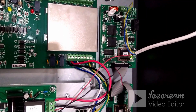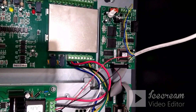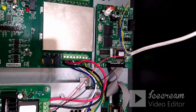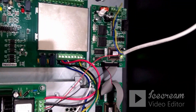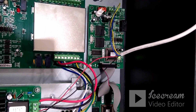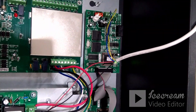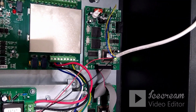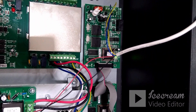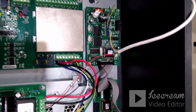In summary: when connecting a GST 200 panel with a repeater panel or another GST 200 panel, you need two network cards — one on the panel side and one on the repeater side. The part code of this network card is P9940A.